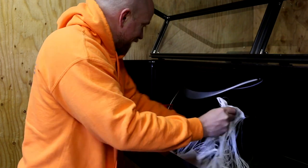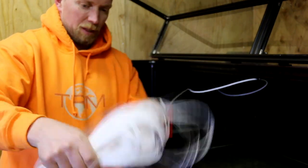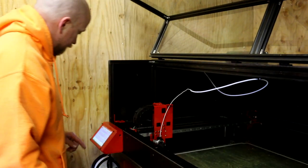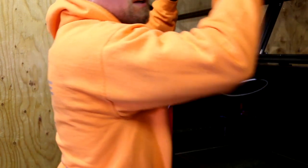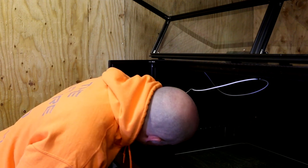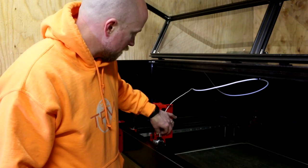All this waste goes in the recycle bin — it is a fully recyclable material. You could actually get a grinder and grind it back up to make your own filament, though it's very time-consuming and not hugely efficient. I can see gears turning but I'm not getting material, so I'm going to contact the manufacturer. It might also be that I'm printing so much that the nozzle head is too small, so I'll do some research and come back to this tomorrow.